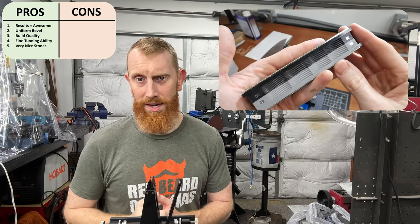The last con is the time it takes to sharpen a knife on the Wicked Edge. Note that I am a novice with this machine, so my speed could likely be increased, but it did take me between 20 and 30 minutes per knife to work up all the grits and strop the edge. If you're re-sharpening a known blade, I'm sure this time could be greatly reduced. As we saw during the sharpening of my in-progress custom chef knife, this machine can form the initial secondary bevel — however, I could see myself roughing in the secondary bevel with my 2x72 belt grinder first to reduce the amount of time hogging off material on the Wicked Edge, which is precisely what the team at Wicked Edge suggested.